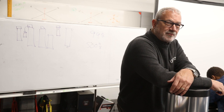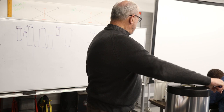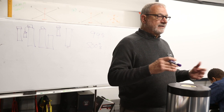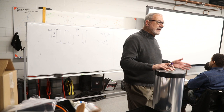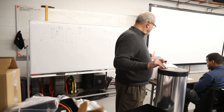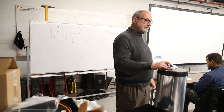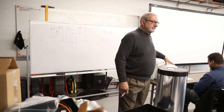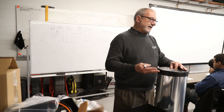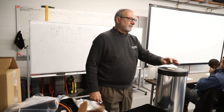We typically have about three sizes of RO system: 50 gallon a day, 100 gallon a day, and 150 gallon a day. It's not how many gallons a day you use — it's how fast you fill the tank, because you're working from the tank. If you use 5 to 10 gallons a day, maybe you want a 100-gallon-a-day system to fill the tank up quicker so you won't be out of water. In my house I've got a 14-gallon tank — with the bladder it holds about 9 or 10 gallons — so we don't ever run out of water.